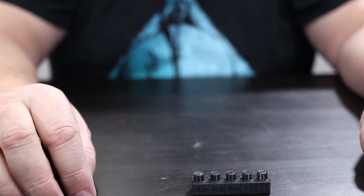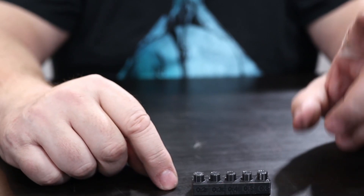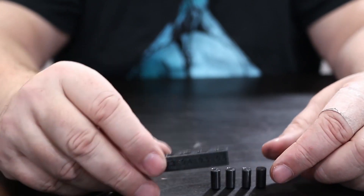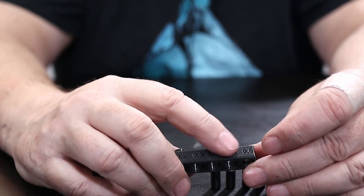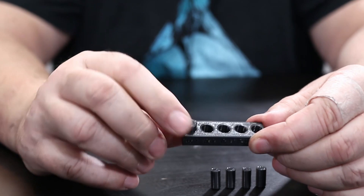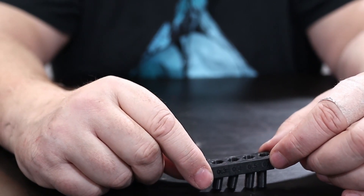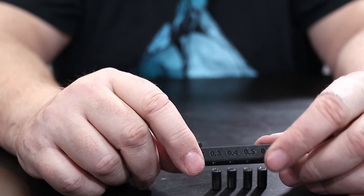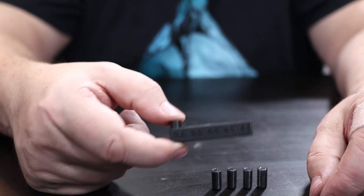This is a zero clearance test, and I was very impressed by it. I also did this on an Ender 3, which did not perform nearly as well. The test has spacings at 0.2, 0.3, 0.4, 0.5, and 0.6mm. At 0.2, I could not get the peg to release, but all the others basically fell right out. At 0.3, 0.4, 0.5, and 0.6 clearances are great — using a 0.4 nozzle. I'd score this a 4 out of 5.